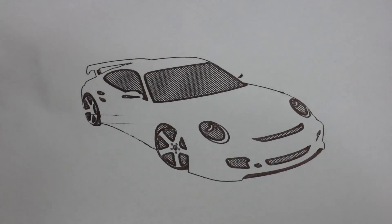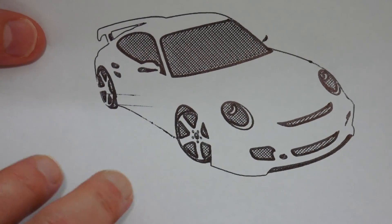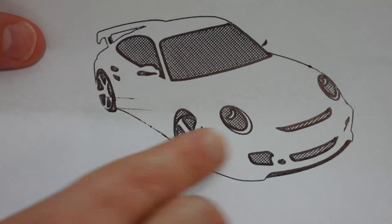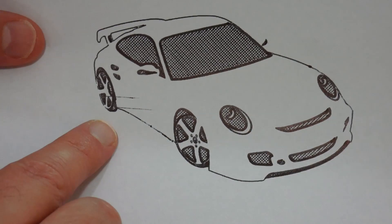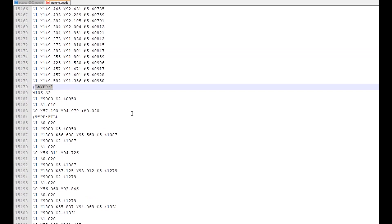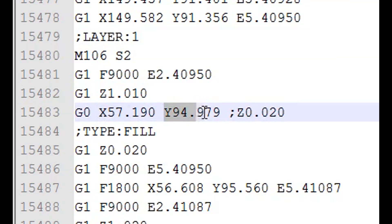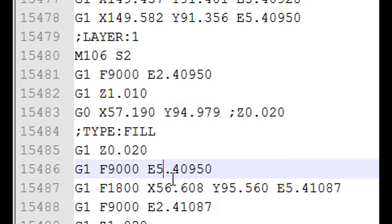But you will see there is actually a problem here. Near the back rear tire, we have these two streaks. What I've noticed is happening is, as this was printed in 3 layers, during each layer transition, not only was the pen moving from over here to over here to start the next layer, but it was also dropping the pen at the same time — so there was a z-axis command while this non-print move was occurring. So again, we can go into the G-code, find where that is, and edit that out. We can open the G-code in Notepad, search for the next layer, and we can see what the G-code is telling it. It's raising the pen here, then moving to the new X and Y coordinates, but it's also interpolating and dropping the z-axis. So add a semicolon — we don't want the pen to drop while it's moving. Anyway, it's adding that pen drop command here, so once again this is a redundant command. We can let this drop the pen and it will continue printing the next layer.